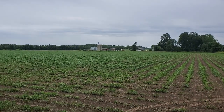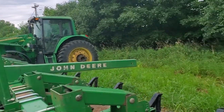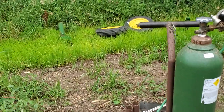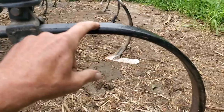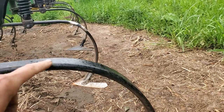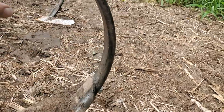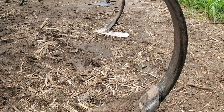I came back out here in the bean field a few days later after making that second pass on the beans. Doing a couple things — first off, on the cultivator there's a lot of rocks out there, so what I ended up having to do is bring the oxy-fuel out here. These shanks are pretty sure they're some kind of spring steel and they're $150 a piece. What had happened — it's happened three times now — it'll get a rock and the spring here isn't enough to kick it out, so what ends up happening is this arc gets bent and this tip goes down into the ground pretty extreme.